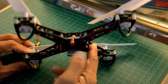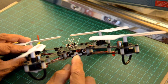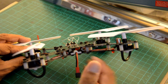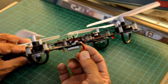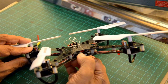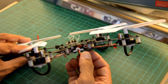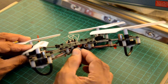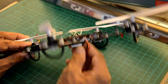The on/off switch and battery connector are well reinforced. I didn't want loose wires on the circuit board because from constant unplugging and plugging the battery, the wires tend to fray at the PCB connection. So I installed a clamp to hold the wires to the frame properly — making it very easy to swap the battery in and out.